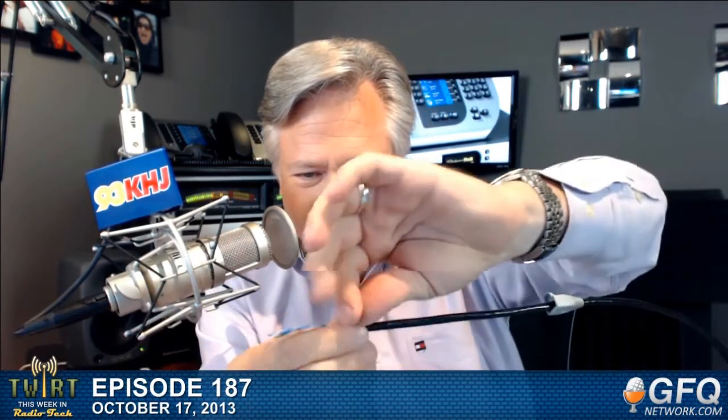Now, there's also this little fiber here. What is that, Chris? This thing that comes along for the ride. That one, you can pull that back. That opens up the cable so you can strip open the jacket. Really? Yeah. Oh, I thought it was there for strength, for pulling strength. No, as far as I know, that's what I was told by several people at a couple of Belden seminars. Oh, well, I've never found. There are some cables you can buy that have a plastic piece in the center that's actually designed to keep the twist in proper place. But I believe yes, a cross shaped. Yes. In cross sections, it'll hold the four. Yeah, I think that's CAT6. And that's that new Belden twist, they call it, data twist. Yeah, I think it's called. Yeah. Media twist. Media twist, that's it.